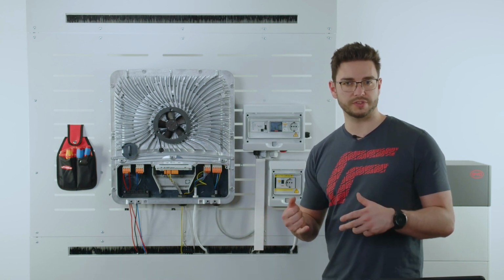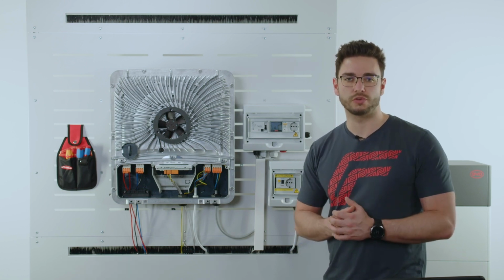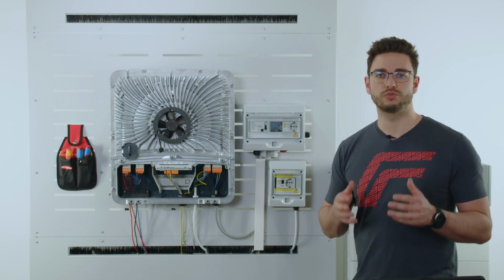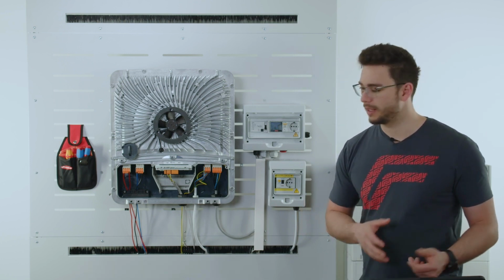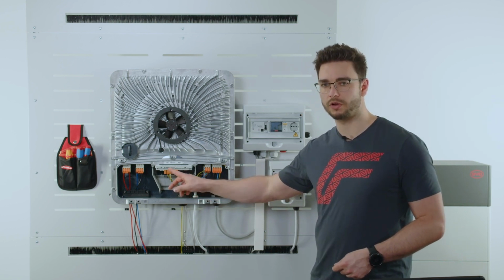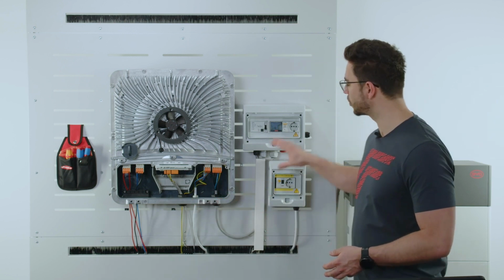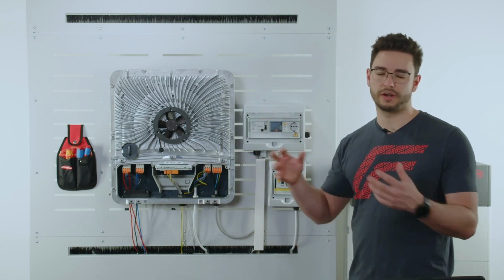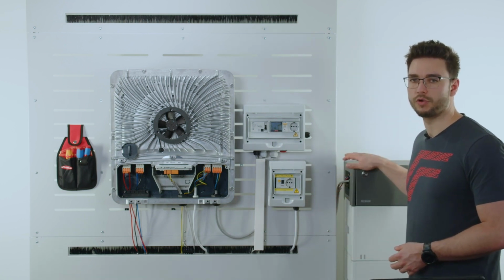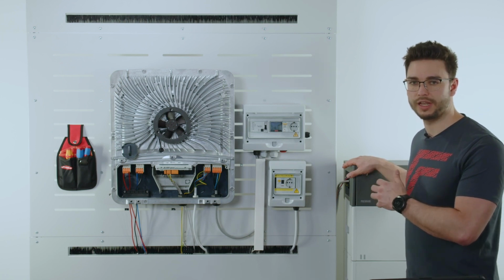Make sure to use a twisted cable pair between plus and minus, and also the ground connection of course needs to be set. And make sure there is a shielded cable and to ground the shield on one side. Now, to ground the shield on one side, this is possible on a shield connection point on the Pilot itself, which is designed exactly for that, or also on the feed-in point, for example, as you are in the distribution panel anyway. Or also the same would be possible for the connection point on the BYD. Here you can also ground the shielding once.